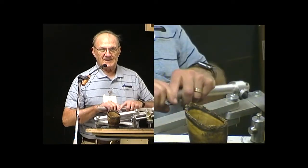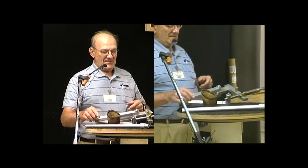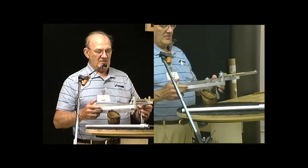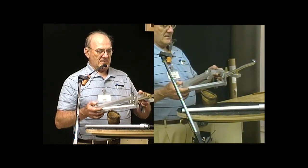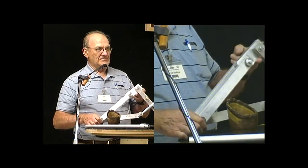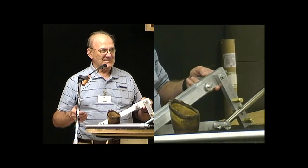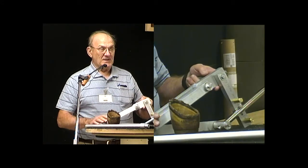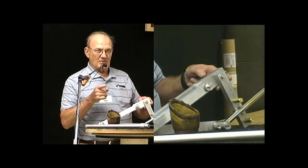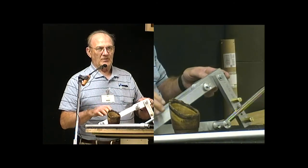And while I wasn't doing anything else, I was so inspired by our illustrious treasurer's demo back here, give him a big round of applause. I liked his demo, that I said, I can do that. So eBay, here I came, and I ordered two 24-inch pieces of 3/4 by 1 1/4 aluminum, and a couple of pieces of 1 1/4 aluminum rod, six flange bushings, and I have a big box of hones that have Morse taper, number two tapers on the end of them, which have been absolutely useless, except with a wrench. You know, you get them in, you try to turn them around. But I found out that the one way is you've got the most beautiful Morse taper speed control, and with the tailstock going into a pre-bored half-inch hole, you can do a beautiful job of reaming to the precision bore that you need to put the bushings in.